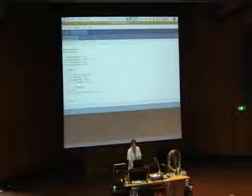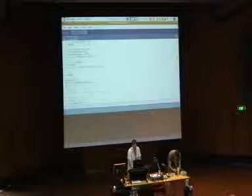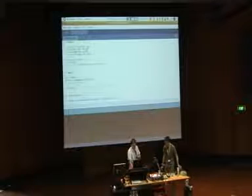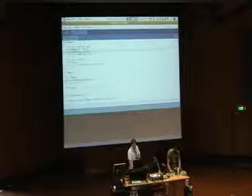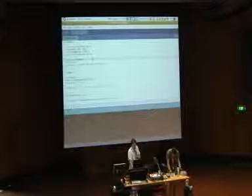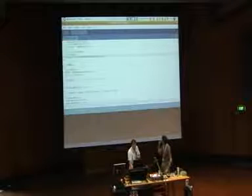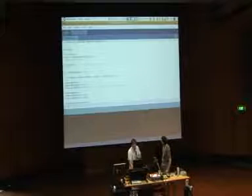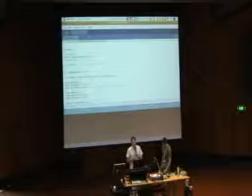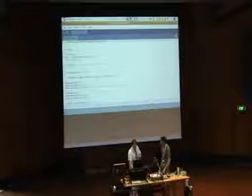So what we're doing is, first we call in setup. We're saying that we want to take data from this input, and we're just setting this output high, so we use it as a power supply. Opening up some serial communications and saying hello. So once it's started up, it should print something to the serial port. It then goes into a little loop. And every 5 seconds, it reads a value by communicating using the one-wire protocol to the actual sensor itself. So let's just give this a go.